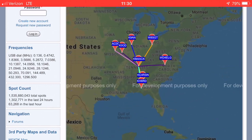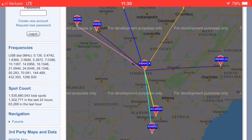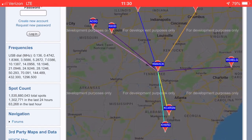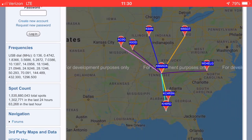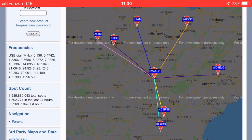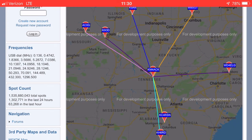Here are the results from the NVIS antenna, and it's actually kind of surprising. I would have thought that the whip would have gotten out a little further, and I thought NVIS would have shortened things up quite a bit more. Maybe there are no receiving stations in Tennessee — I'm honestly not sure. Of course, we're running a compromised antenna pretty much any time you're dealing with something hooked up on your car. A little shocking for the results, but nonetheless kind of a cool test this morning.